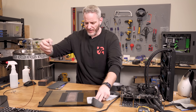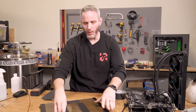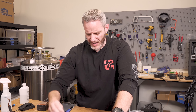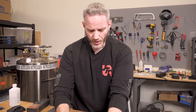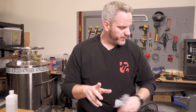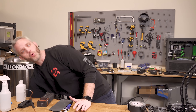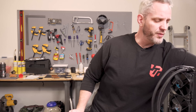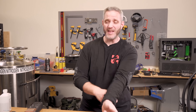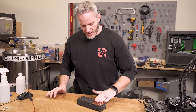There are a couple of other things to address, because my other issue is not just the flatness of the mount, but the even pressure of the mount. I'm having such a hard time using that little retaining bracket that came with the air-cooled cards — I don't think it's giving me enough pressure. It's probably plenty of pressure for the air cooler, especially when you're not dealing with extreme temperatures and extreme core clocks like we are. I'm trying to get this thing up to 2640 MHz and up. I've achieved it once — my previous best score was with 2640, but my next best was with 2625, and I haven't been able to get 2600 to run since. I'm 100% positive it has everything to do with my poor mount.